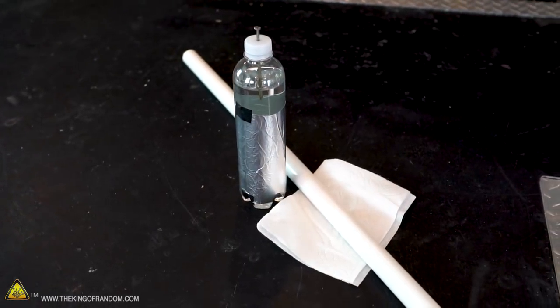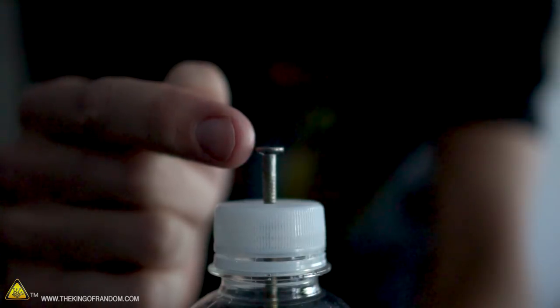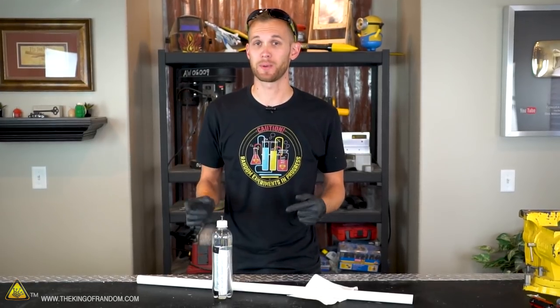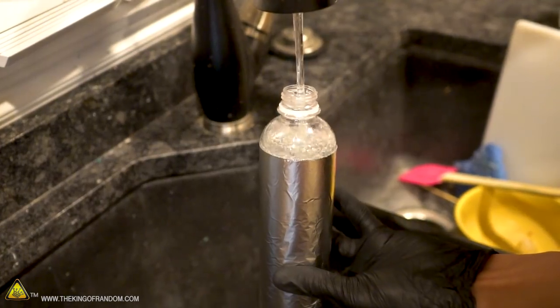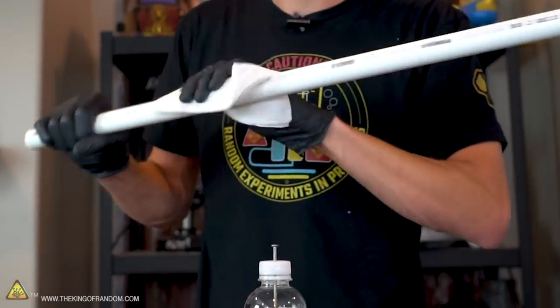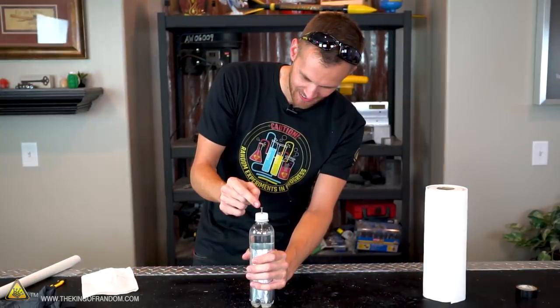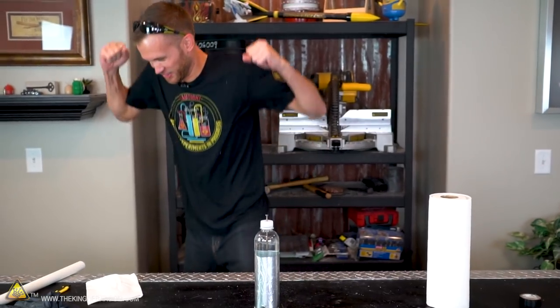There you have it — now you know how to build yourself a Leyden jar, which is an early type of capacitor. A capacitor is similar to a battery except that instead of discharging its electricity slowly, it dumps all of it at once. This Leyden jar capacitor is made just by using a plastic bottle, some aluminum foil held on with tape, and a nail. It's filled with water with a little bit of salt added for conductivity and charged up using the static electricity generated with PVC and a paper towel. We tried charging up our Leyden jar using our broken plasma globe, but apparently it's not anything that will charge this up. If you know of a good experiment you can do with a Leyden jar, let us know in the comments and we might try it out.